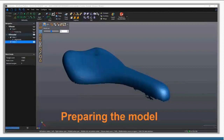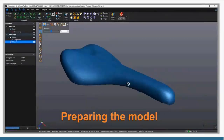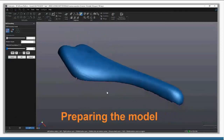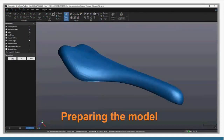Now I need to prepare this model — I can't just CNC a rough STL or mesh file. This is Creaform's software as well. I can clean up the model and delete some extraneous data. Then I can fine-tune the edges and smooth out the boundary using the Edit Boundary tool — just select the boundary and it automatically smooths that curve when applied. Then I use the Automatic Clean Mesh function to clean up spikes, self-intersections, and any irregularities in the file.